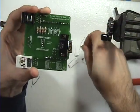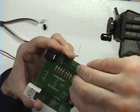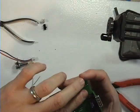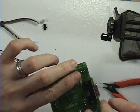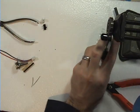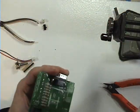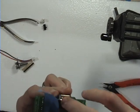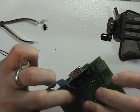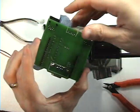And now the 10Ks. So there we go. Now we're going to flip this over and solder, but when I flip it over the things are going to come out of place. So what I can do is get some painters tape like so — just a little trick — and tape them on. That way when I flip it over they're not going to get out of position. So now I've flipped it over and they're still in place. Now I can solder.